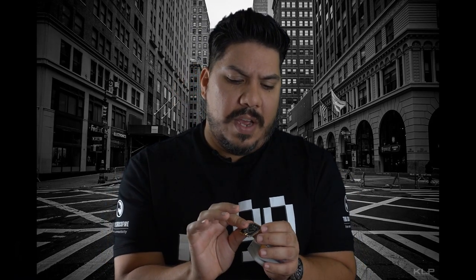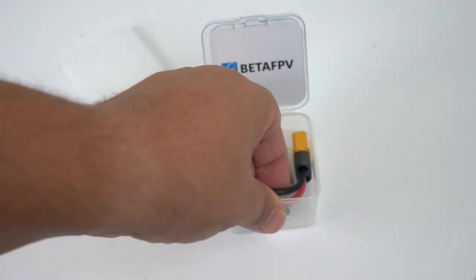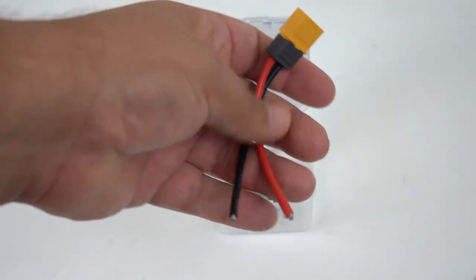I am testing a variety of 5-inch racing formats that come well under 200 grams, with a battery probably closer to 230 grams total. And this might just be the ticket — if you get the weight that low, the power requirements are going to be a little bit less. If you install the proper amount of capacitors on board, perhaps you can protect from even those hard gate hits. So really, is there a frame combination with brushless? Let's take a look at the bench — this is the beefiest of them all so far.